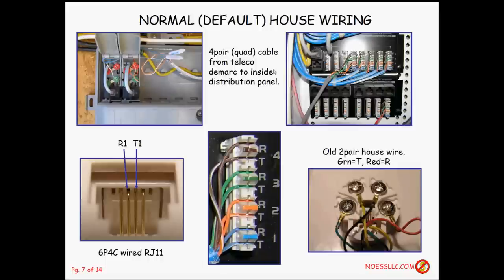On the back of the panel you can see the wiring coming in. On the quad going to, say, the living room, I punch down the blue and white, which carries phone line one to the living room. Because the telephone company gave me line one on blue, and the blue on the quad goes to the back of this panel and across, all I have to do is make sure the blue-white is attached to the back of this 6P4C jack — and voilà, I've wired the RJ11.